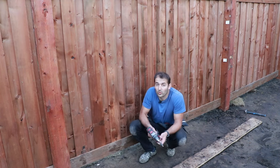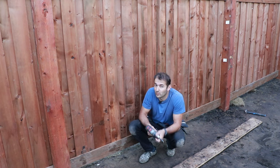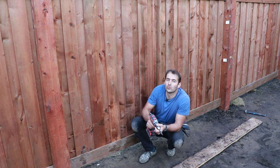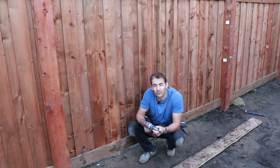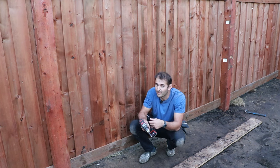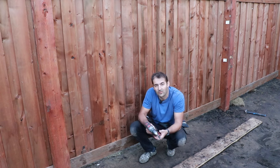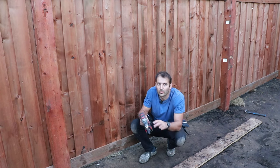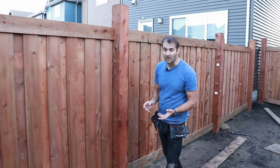For the covers, we use 1x6x10 feet long boards and cut them to fit the space between the posts. They cover the rough ends of your planks at the top and bottom, even out any uneven ends, and also cover those screw holes from all the screws we added. This is our final product — really a beautiful fence.